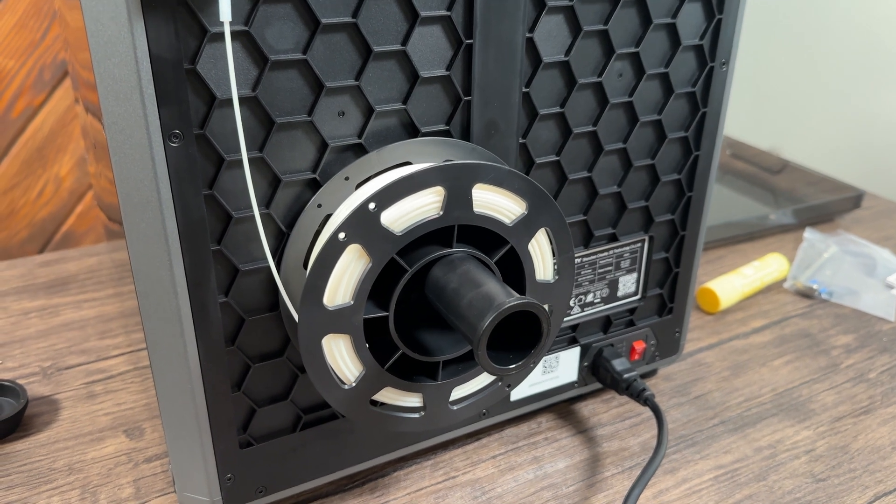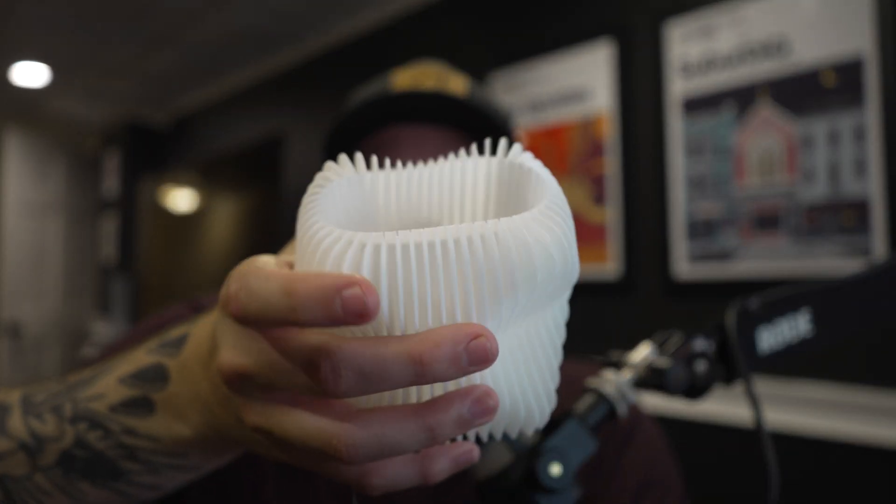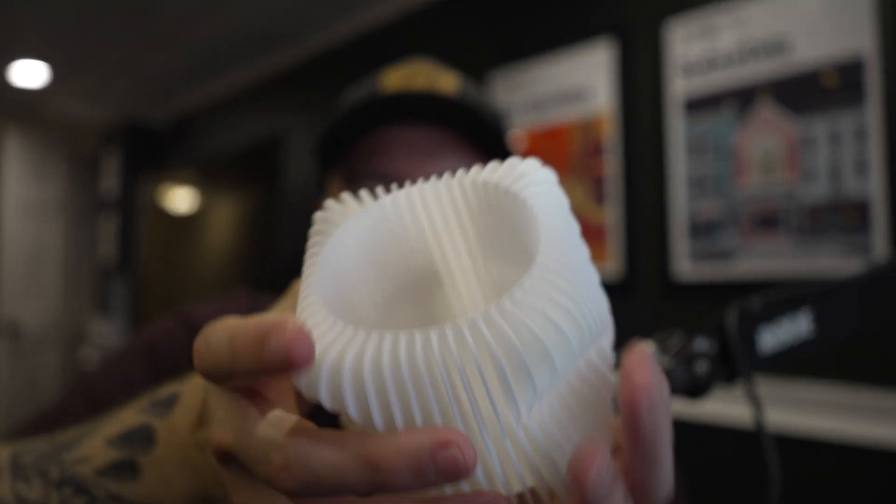After that, I went back to the hyper PLA since Creality was nice enough to send me a roll or two. I printed this in vase mode, and it prints no problem in vase mode. It's super flexible because it was printed with just one continuous layer — it's like a little pencil holder slash planter or something. My wife likes it, so that's what matters. Interestingly, I ran out of filament somewhere around the middle and was able to unload and load new hyper PLA with no issues, then continued printing in vase mode — no problems at all. Awesome job K1 on that test.